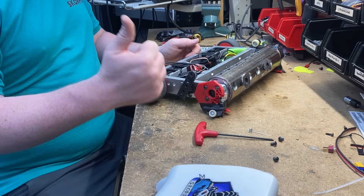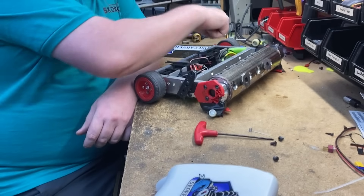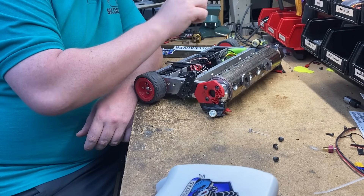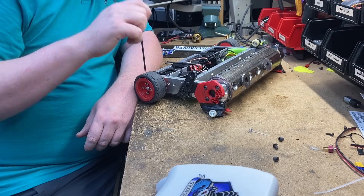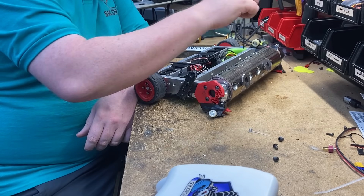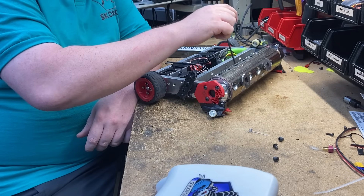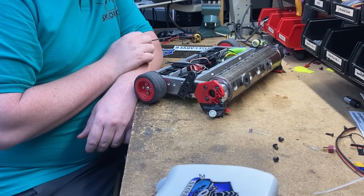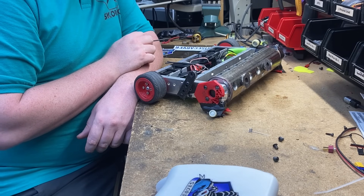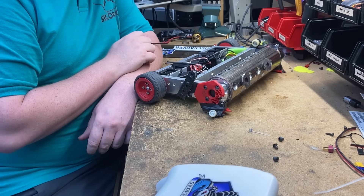Lessons: if you're going to fight on wood, make sure your tires have the center of gravity directly between them. Instead of having the center of gravity behind the wheels, it should be over them. Or if you have a four-wheel robot, the center of gravity should be in the middle, or at least between the wheelbase. I was really on to something with front wheels, and I truly paid the price for abandoning the four-wheel concept when I got afraid of how heavy this thing was.